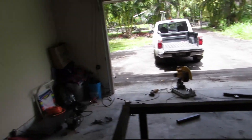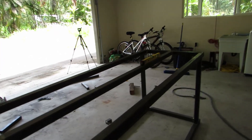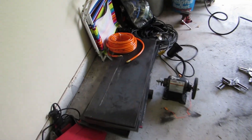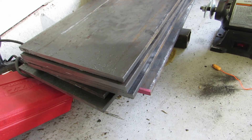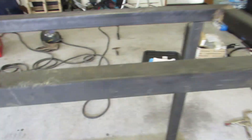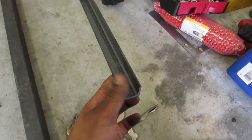Instead of buying one piece of plate, I don't have anything to move a 7x3 piece of half-inch plate around — I don't really want to lug it around by myself. So I decided to just get this 12-inch flat bar. It seems like it's gonna be pretty sturdy and it shouldn't want to warp too much. That flat bar is just gonna be welded to this middle section, also just to prevent warpage. I actually picked up some 1x1 eighth-inch angle — I'm probably going to be using that as a gusset on these edges where the surface is gonna overhang.